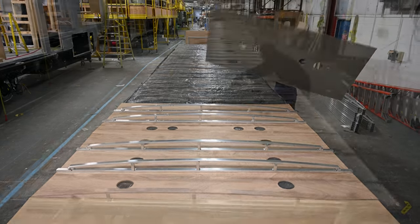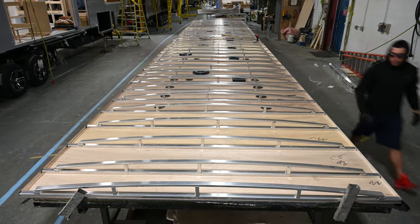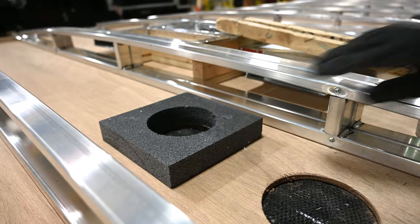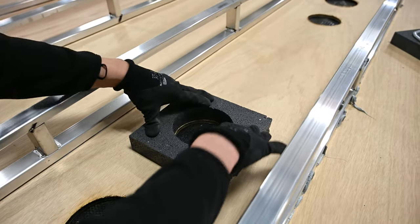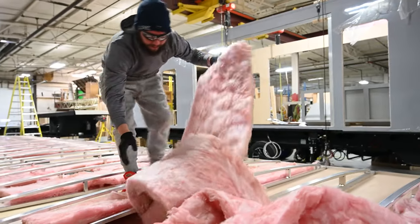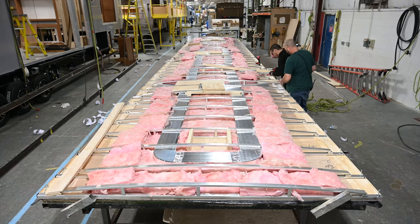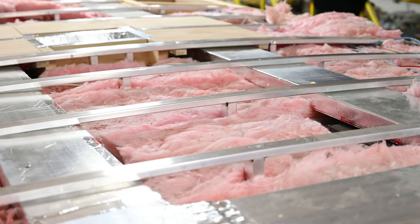The welded trusses are mounted 16 inches on center and doubled up at the location where the AC units are mounted. We utilize our graphite closed-cell block foam insulation to further insulate the AC duct for maximum efficiency. The first layer of R7 residential batting insulation is placed in between each of the trusses, and the insulated ducting that delivers the air conditioning is placed above this and connected to the vents.